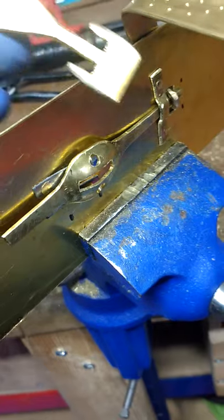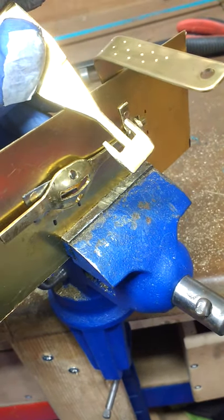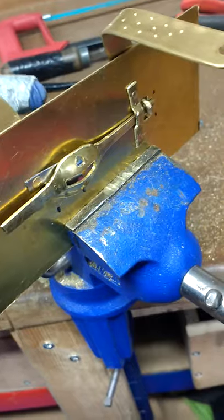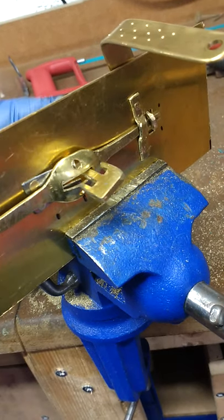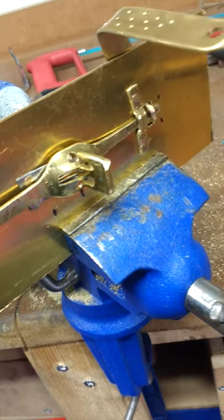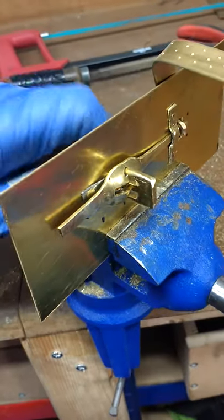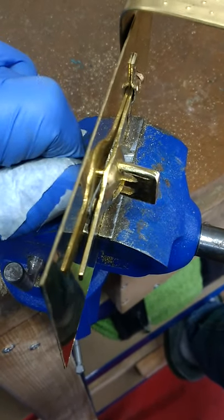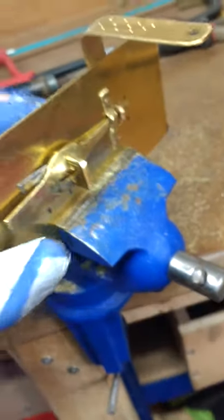The only way to do this is to take a key. Many of you have seen keys like this — sometimes they've got a prong either side, sometimes two or three prongs on the bottom, and that relates to how many little holes there are on the sliding bolt on the back. This gets passed through from the outside, right through inside the bolt, then gets turned. The two little prongs go through the two little holes, and as I pull this towards the lock plate, I can depress the springs down, which allows me to slide the bolt backwards and forwards — so in effect I can lock and unlock the box.